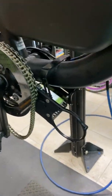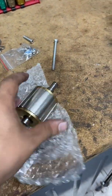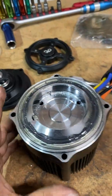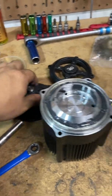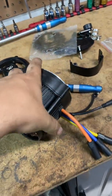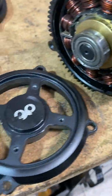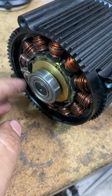We're inspecting this CYC motor, just dismounted it from the bike which was real easy. Now we're taking a look at the stator — we have a replacement rotor here. This is an internal stator but it's jammed up, so we want to figure out why it's locked up. We've already taken off the top cap freewheel and done the backside as well by prying off the case very slowly. Now we're going to inspect this and see what's wrong.